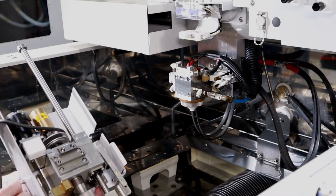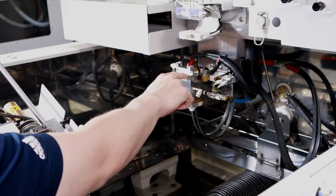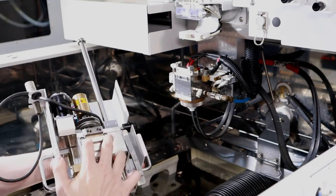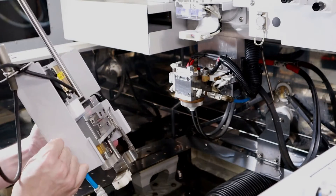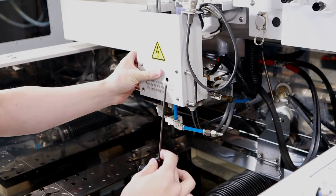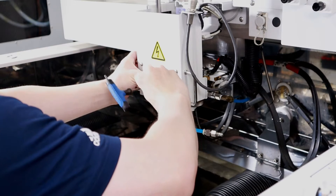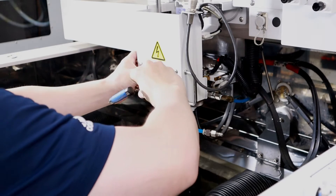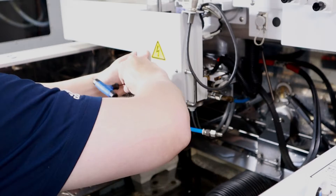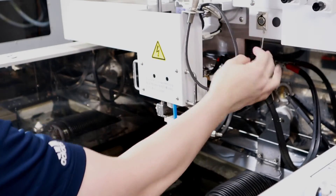Now we move on to the mounting of the SHM. There's a bracket installed on the top here, and there's an insert that fits right into the middle of that, with two screws already set in there — we just screw it in place. We put that on, take our 3 millimeter Allen wrench, lock one end in place, come over to the other side, lock that end in place, and uncap the electrical.